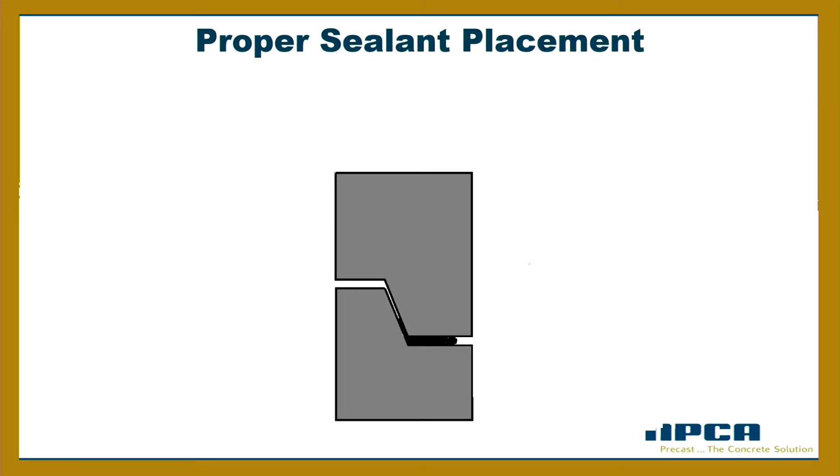The other thing I'll say real quick about these joints is that when the tank comes out, where you're applying that sealant, just pay attention to that surface. If you're having any issues with that surface, talk to the precaster. Hopefully there's no issues. But sometimes, depending on the way it's poured, the tank's sometimes poured upside down, sometimes poured right side up. But that surface where the sealant goes on can be all flaky and honeycombed a little bit. And then you put sealant on it, and the seal is fine, but the water's going to go around underneath the sealant and then go through.